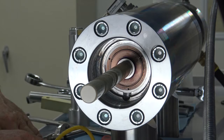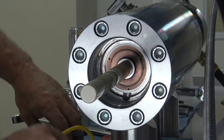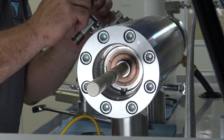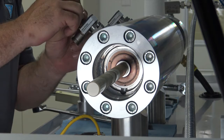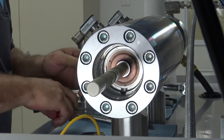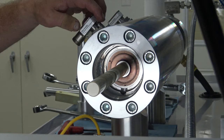At this point, you've got your plunger back in along with the new hydraulic cartridge. To finish, stick your proximity switch back into place and tighten it down. When you final tighten your proximity switches, check your manual for the specific torque setting on those bolts.